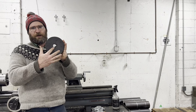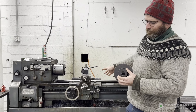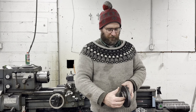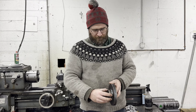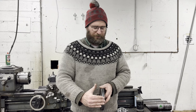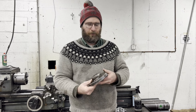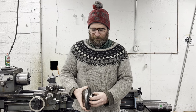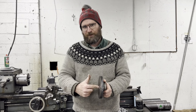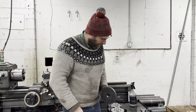From there, we're going to drill this out to inch-and-a-quarter, which I've already done, and then put it on the standard modern lathe. We're going to do two ops. First, we're going to hold it from the inside, make this face 2.80 inches, and ensure it's parallel with the bore. Then we'll take this down to 6.125 inches. We'll flip it, grab it from our parallel surface, face it, and bore it out to 1.5005 for a slip fit over our inch-and-a-half driveshaft.